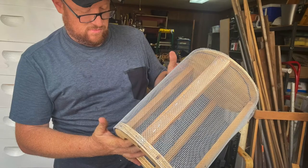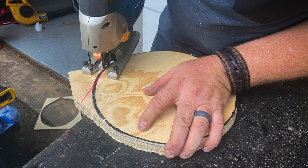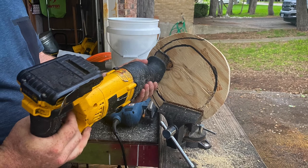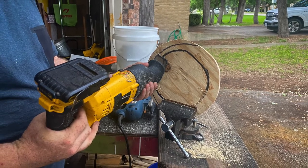While you're waiting for the glue to dry, you'll make the wire basket. Cut two nine inch diameter discs from your one eighth inch plywood and one nine inch diameter disc out of your three quarter inch plywood. Scribe a circle about an inch toward the middle of the thicker three quarter inch disc, secure it in a vise, and cut out the middle with a reciprocating saw to make it into a ring.